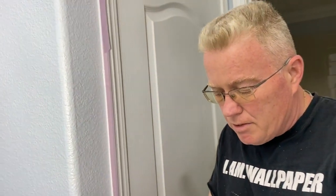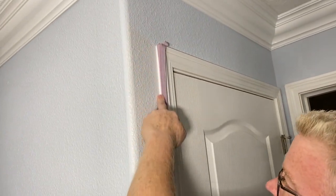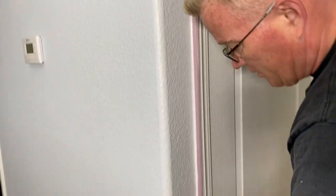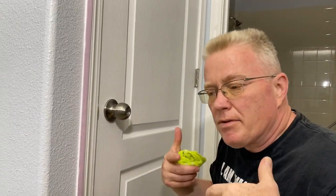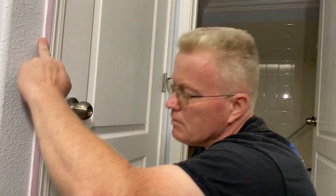I'm using white caulking — please take note. White caulking is good in this case because behind the white caulking is white paint. But if you had cream-colored trim and blue or gray paint on the wall, you wouldn't use white caulking — you'd use clear. The clear dries clear and allows the cream-colored trim and the gray or blue wall to show their colors at the corner as they are, because it's transparent. But if you use white in that situation, bad. If you keep caulking on your van or truck, keep clear so that it doesn't matter what color is behind it. You understand?